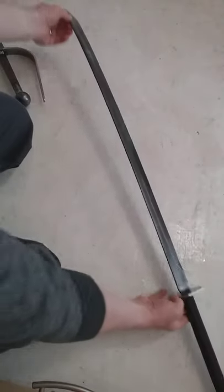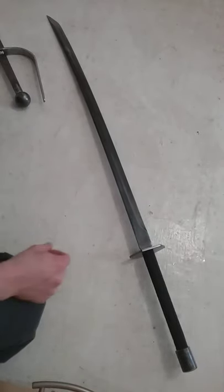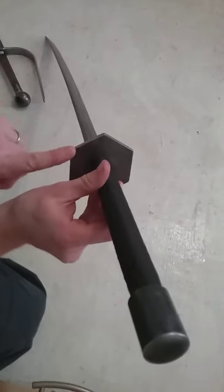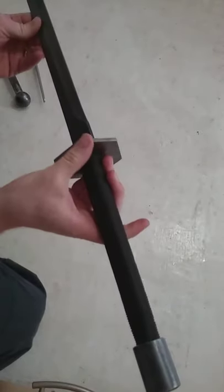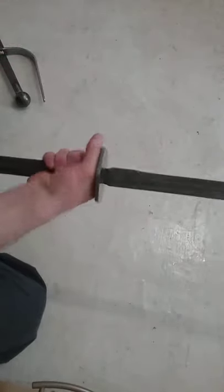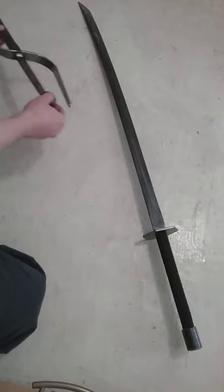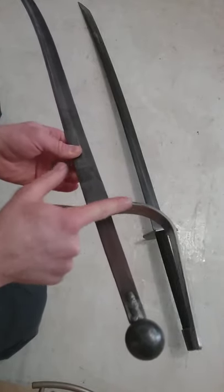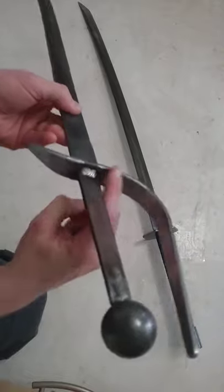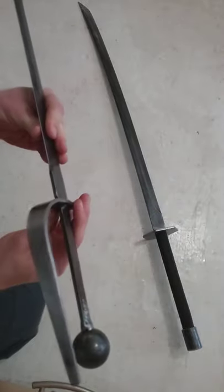It's a very high carbon steel in the blade, so it is prone to rust. Definitely use their Choji oil — they make the best I've ever used — to keep it from rusting. As for construction details, the bottom edge of the guard is not as sharp as the top edge; they've gone to some effort to round that. I would probably do a little more if I were constructing it, but they've made it large enough that it doesn't contact your hand. I did grind this a little bit carefully so as not to heat it up and remove the heat treat, and they told me that was okay. They're a lot less picky about warranty issues than a lot of other companies, which is great.